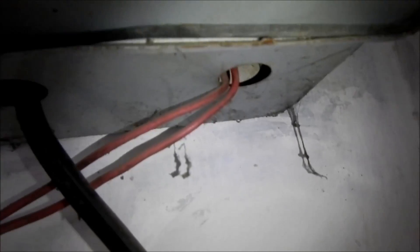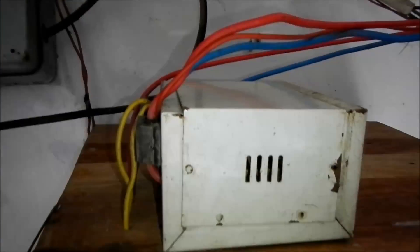This conduit here, where it's not the thick heavy black line, this is the utility input power. These red lines that come out — and I see some exposed wire here — this is the mains input to the school breaker panel, which is interfaced to the solar system with this automatic transfer switch.